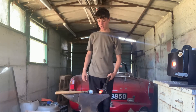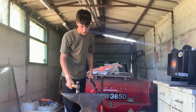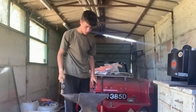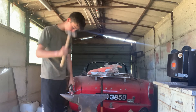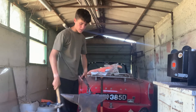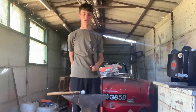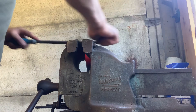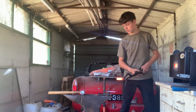That's rounded up now, just gonna try and get the rest of them all to this point. This is hot again, just gonna knock a bit down. Now that's been taken down a tiny bit, just gonna flatten out the end. Come over to the horn and just clean up the transition, tidy up the sides and the faces again. I'll get this hot and just rasp off all the edges, make it nice and rounded, then take this file and just knock the top off.